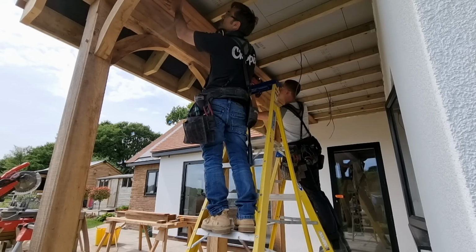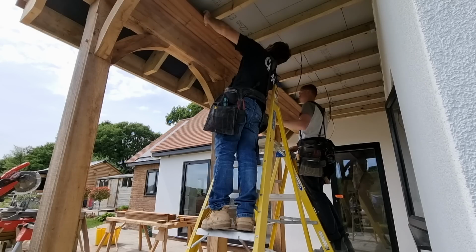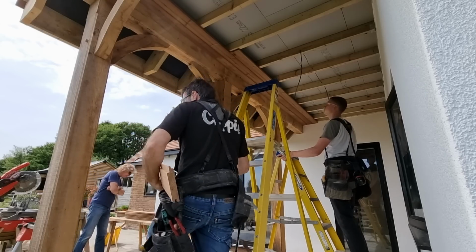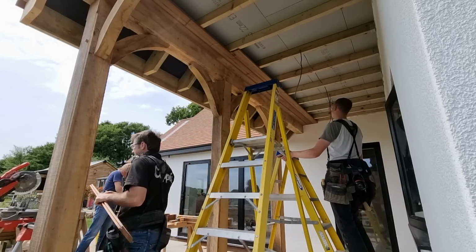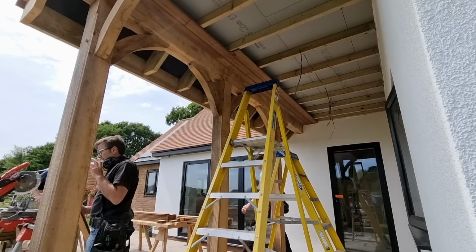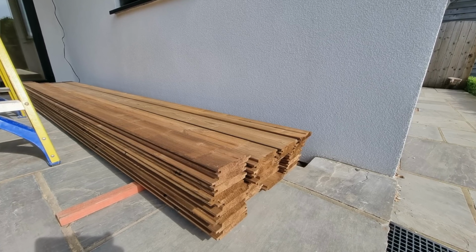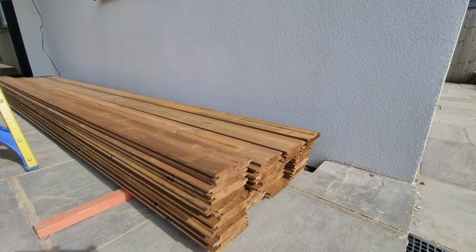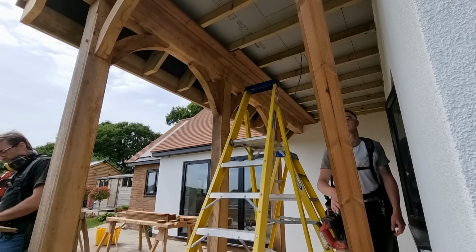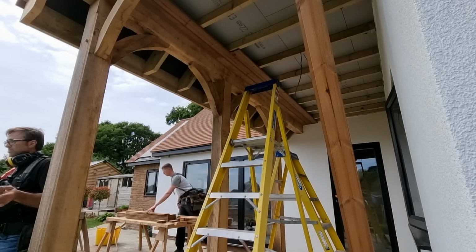No, it's beautiful. Thermo Wood. It's treated with steam before it came on site. Basically they suck all of the moisture out of it, and then they steam it, and it changes the molecular structure of the timber, which resists insect attack, and it weathers really well. This is just a standard softwood that you'd never use outside on its own without anything on it. It's just a fast-grown redwood. But it's beautiful, and it's very stable because they control the moisture content. You can put it up and it stays perfect for pretty much forever.